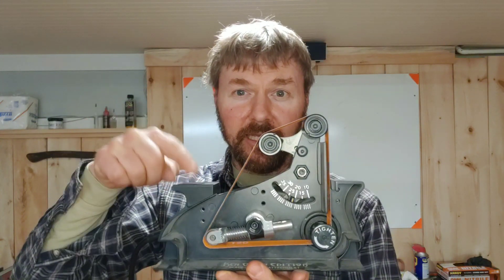They also made this blade grinding attachment — same motor, same housing. This is what I'm actually a little amped about, though it's an additional cost if you're buying the WorkSharp. It's like a little 1x30 — you get a platen, they left the top open so if you need to do any rounded work you can. They have a guide here where you can set the angle. I have it set at 21 degrees now, which is what I'm going to do this chef knife at.